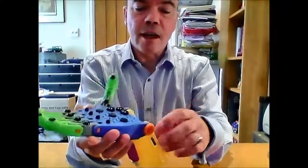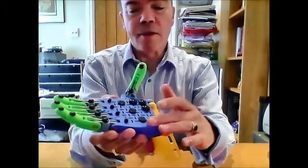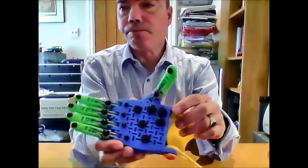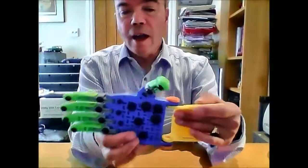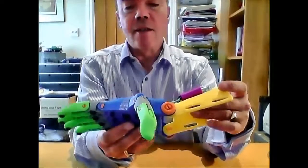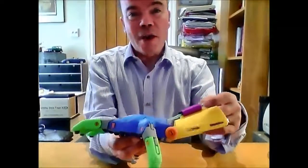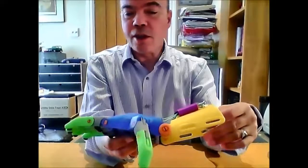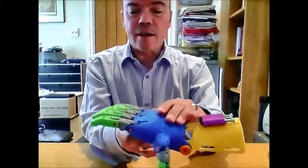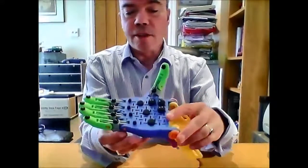In previous prints I've found that these corners can lift up and come out of alignment, but using the 3M tape there were no issues with that at all. As far as issues with printing, there weren't really any. This is the third one that I've done — I went through the learning curve with the other two hands. Hopefully I've ironed all those issues out now, I've got the print settings right and the component fit right, so this one's turned out really successful.